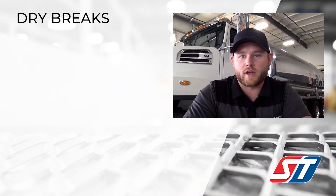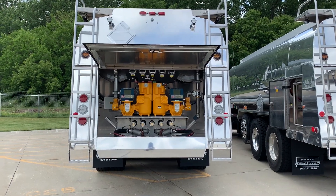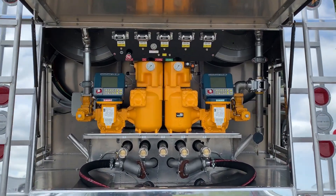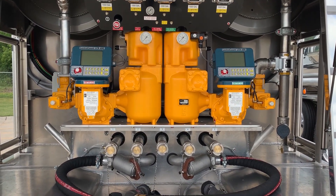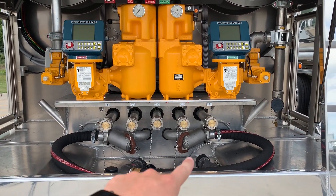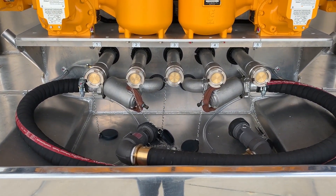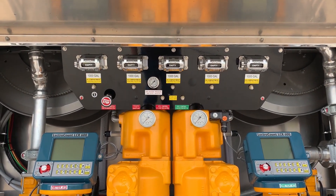Let's go over how to operate a dry brake unit. First, let's take a look at the piping under a dry brake style tank before it's mounted on the chassis. This is the tank equipped with dry brakes — it's a 5,000-gallon tanker with five compartments, 1,000 gallons in each. You can see it has two systems, street side and curb side, five dry brakes that go to each of the five compartments, and two whip hoses or jumper hoses that go to each of the systems — that's how you do your product selection. This unit also has the Seneca Tank Pro air panel and a direct pump off.